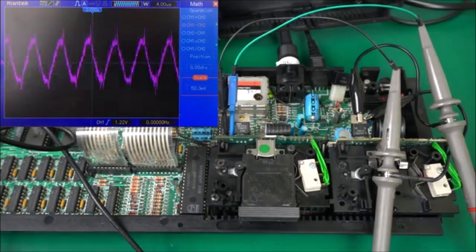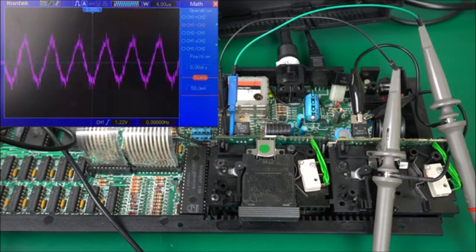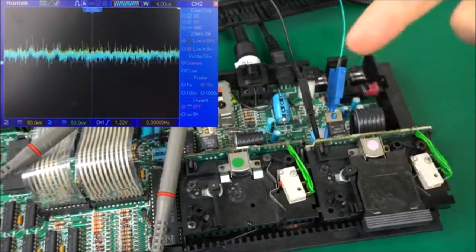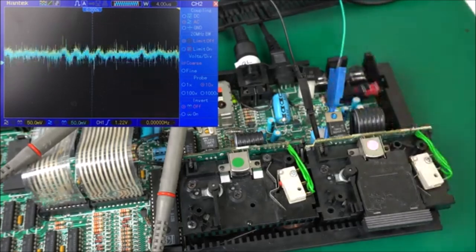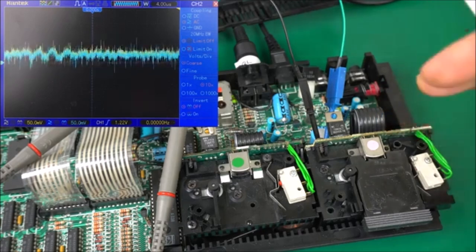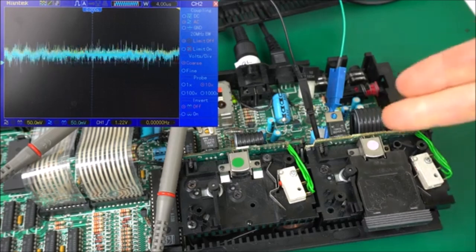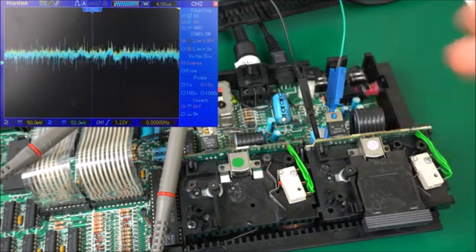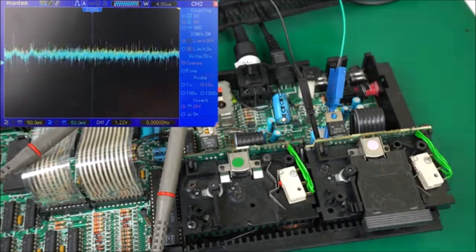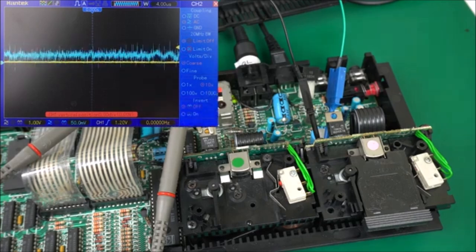So now let's look at that same thing on microdrive 2, the one that is faulty. Okay, here we are hooked up to pins 4 and 5 of the ULA of the second microdrive. Specifically, that is the data 1 half of the ULA. And data 1 is the one that we were seeing a failing signal from the read part. So let's see, we're going to do the write. So I need to adjust this to 1 volt like earlier.